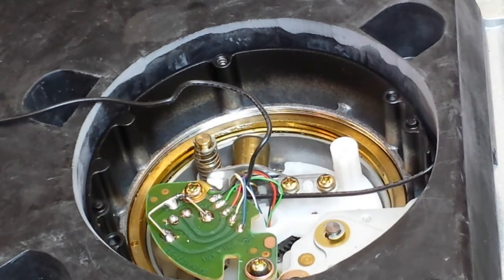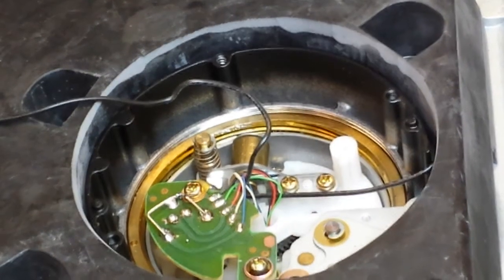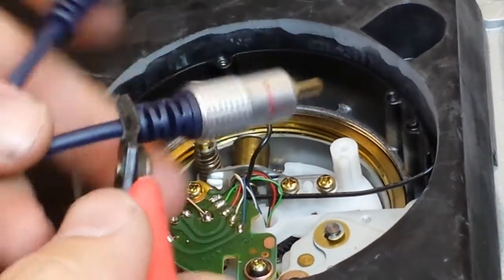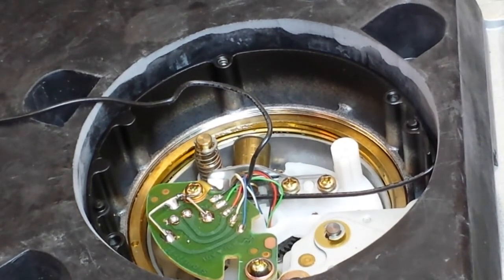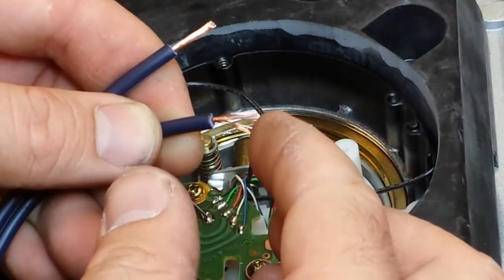The cable I like to use is this MCM cable, part number 24-12492. The reason why is it's really well made, really well shielded, and it's cheap — it's only about $5. Go ahead and cut the ends off like so, and I'm going to strip back about a half an inch. Make sure to use really good wire cutters so you don't kill the coax too. Then we're going to separate the pieces and separate the coax from the signal.